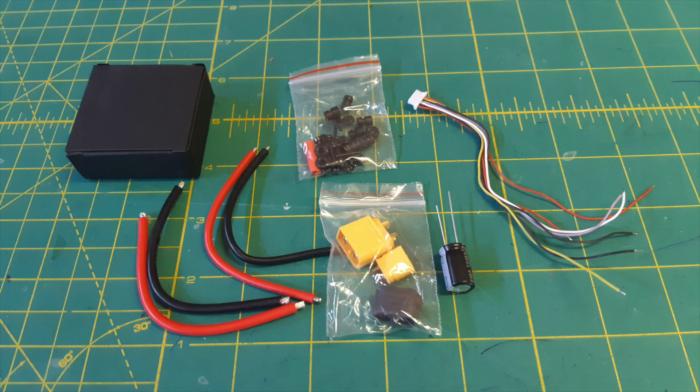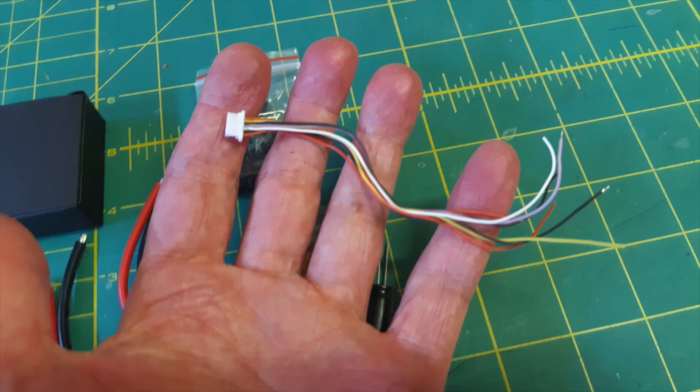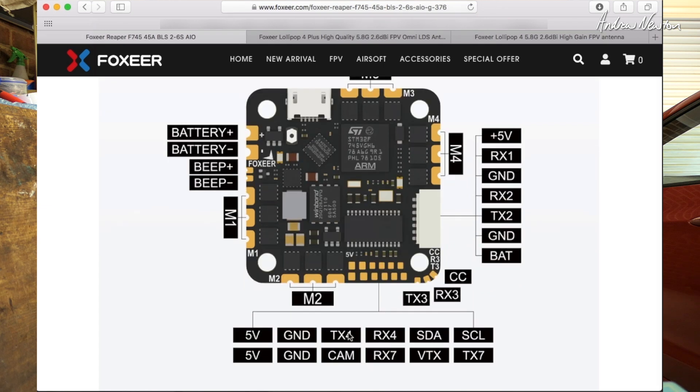It's supplied with battery cables — XT60 and XT30 — and a 470 microfarad capacitor, plus a plug for connecting the DJI HD FPV system straight into the unit. Over here RX2, TX2, and RX1 are for connecting the DJI system. Motor 1, Motor 2, Motor 3, and Motor 4 connections are here — the three motor wires connect straight onto the board. There's a beeper over here. The arrow indicates the front of the board, with the boot button at the back. UART 4 plus I2C for GPS and compass, camera connections, video transmitter, and video transmitter control are also present.